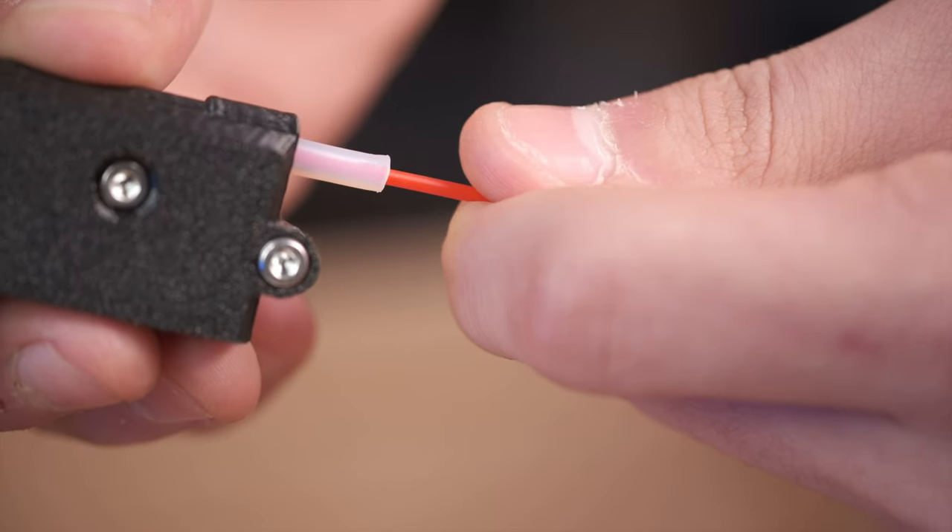The other tool you're going to need is an adjustable wrench to hold your hotblock in place. If your printer uses a rigid hotend like our Mosquito, then you can just change nozzles with one hand. But if you use a traditional hotend design like our Copperhead hotend, you're going to want to use this wrench to stabilize the hotend during the nozzle change. Next, make sure your filament is unloaded from the hotend. Changing a nozzle with filament in the path can damage your hotend, especially if you're changing your nozzle cold.